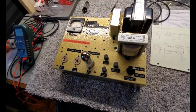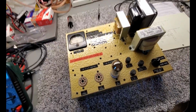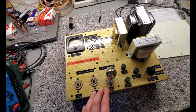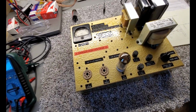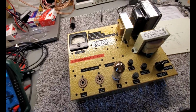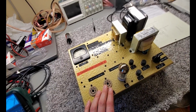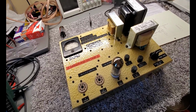And so we saw an entire batch of rectifier tubes basically failing in 2845, and we needed a way to pre-screen them. An arcing rectifier is really hard on the power supply components, the power transformer, and all that stuff. Now, luckily, in 2845, we've got protection provisions which actually worked and saved the amplifier from any damage. There's some internal fusing inside 2845 that's designed to save the amplifier should an issue like this occur.